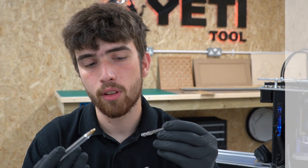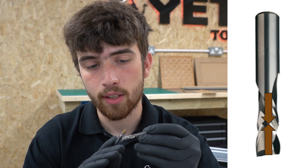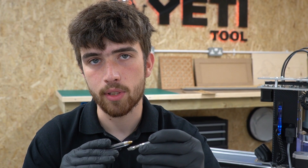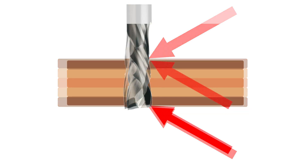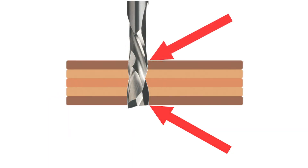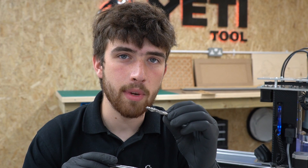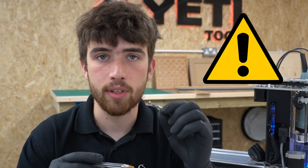A compression cutter does both. At the tip of the tool it has flutes that wrap clockwise, then further up the body they change direction to wrap anti-clockwise. This means you get compression on both the bottom and top surface of your stock material. Remember, a compression cutter is only good if it's used correctly. If the upcut section contacts the top material surface it will cause chip breakout. Used correctly, the downcut section contacts the top surface to push down and stop breakout. However you need to pay particular attention to your feeds and speeds, as extra compression will seriously reduce its ability to clear chips.